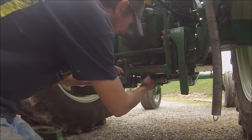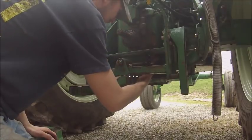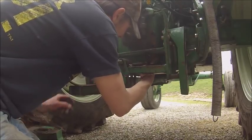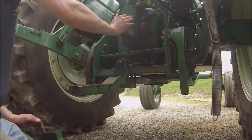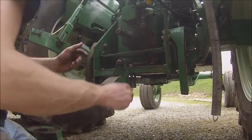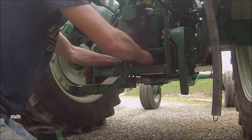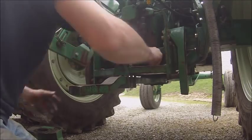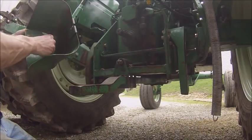Feels like we're shifted — yep, we're shifted. Take the bolt out and put it back in. Because there's no air vent, that thing sealed really well and air pressure will keep popping it out, but it's no big deal — it'll go in once you put the bolts back in. Tighten your clamp bolt back down and jam it, then put your PTO shield back on.